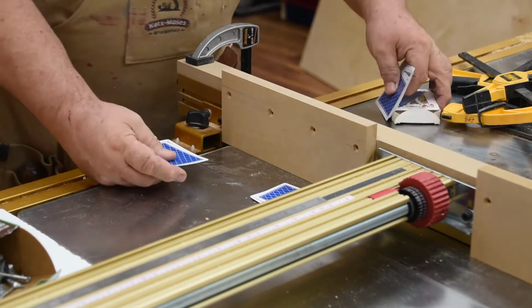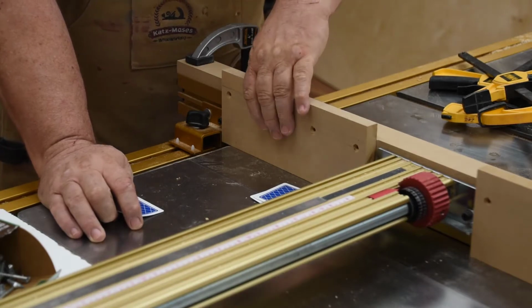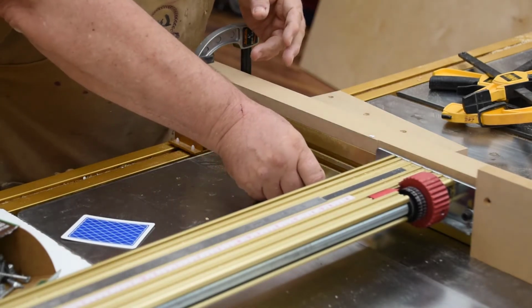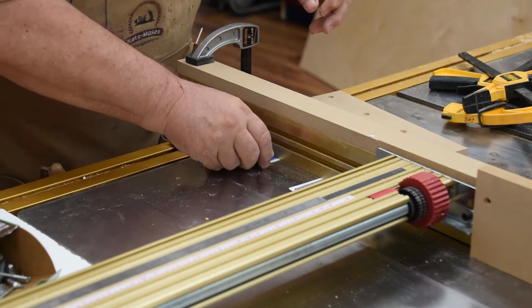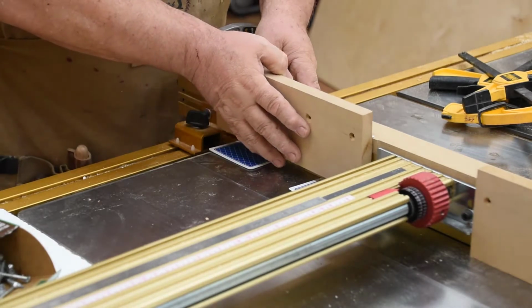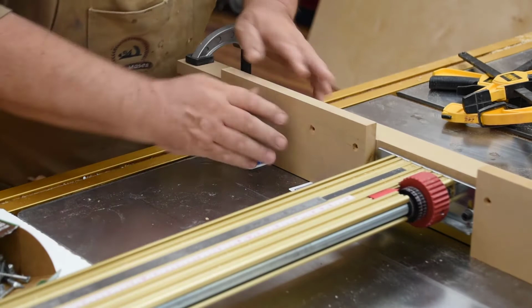I needed a way to give clearances. I wanted 2 cards thickness under the top and 4 cards thickness under the back. This would ensure that the front of the fence would sit tight on the table saw top. By placing 2 cards under the back when attaching the top, then placing 4 cards under the back when attaching the front, I would get my desired outcome.